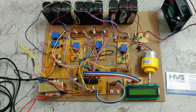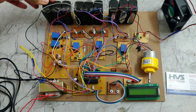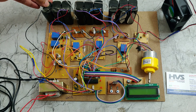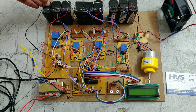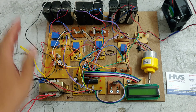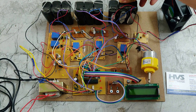We are using three batteries. Each battery pack has a 12 volt 1 amp rating. Each battery has a 4 volt 1 amp capacity. If we add the batteries in series, it becomes 12 volts with 1 amp capacity — in series, voltage is added and current remains the same. Battery pack 2 and battery pack 3 are made the same way.